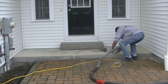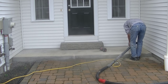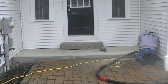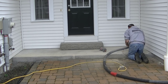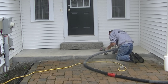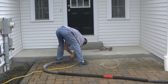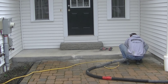The first thing we've got to do is remove that damaged concrete. The best way to do it is with a little four-inch grinder and a vacuum. You're going to want to wear a mask and some glasses. Sometimes there's more damage than just what meets the eye. Picking at it with a screwdriver or tapping on it with a hammer will remove some of it, but it might not get all of it. We don't want to resurface over any damaged concrete because it's just going to fail fairly quickly. If you've never used a grinder, just tapping with a hammer may be enough.